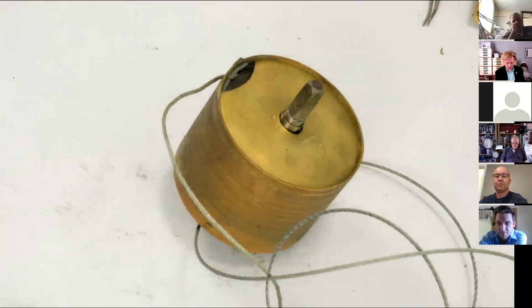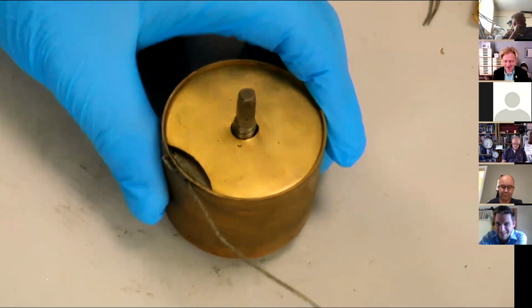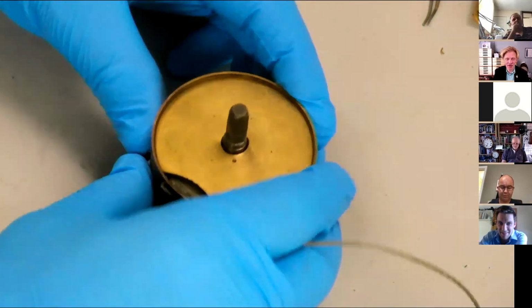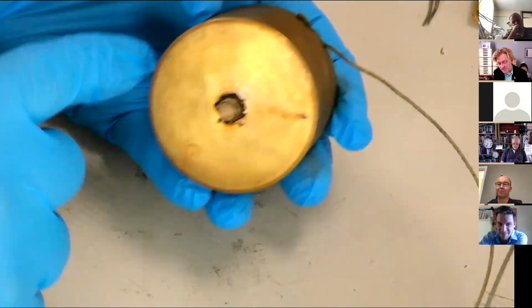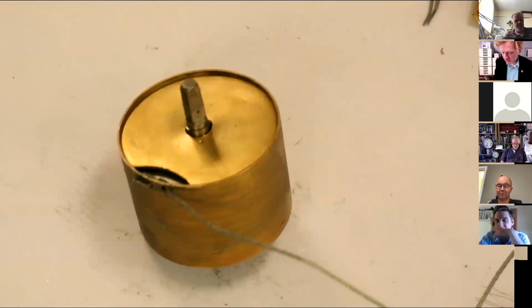Right, okay. So let's pop off our barrel cover. Don't whack it on the bench, please. Don't whack clocks, just go at it as gently as you can. We've had a big run in with people saying, smash the barrel down on the bench. These barrels are not from solid, look, it's fabricated. You don't want to begin to break these soft soldered joints.